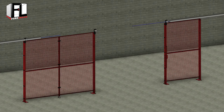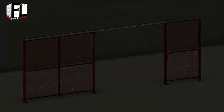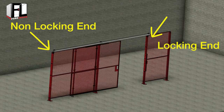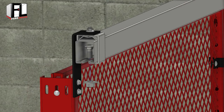The next step is to install the track. Slide the track into the brackets that were mounted to the three line posts. Note: if the door is wider than eight feet you will need two tracks; for doors six foot or less you will only need one track. Then insert the slide door assembly with the trolleys into the track at the opposite end that it will lock at. Once the slide door is in place, install the stopper just inside the end of the track to keep the door from sliding out. It goes on the same end of the track that the door went in on.